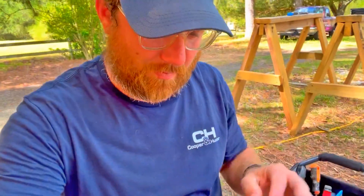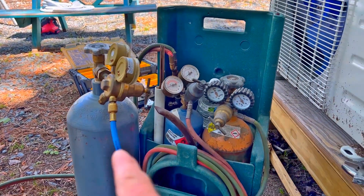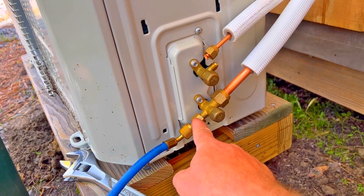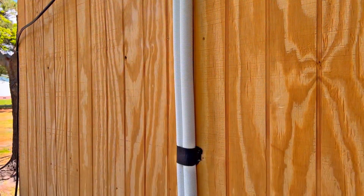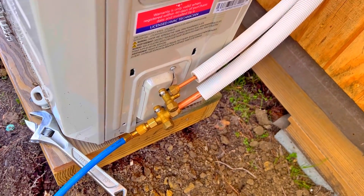It's hard to do that while trying to hold the camera, but we got to just over 25 - right at our torque specs for this one. The unit started to shift a little bit, I should have screwed it down - hindsight is 20/20. What I did next is braze up the unit using my oxygen-acetylene torch. I set a little bit of low-flow nitrogen through all the way into the vapor line. We step down from five-sixteenths to one-quarter inch, just like most mini splits, so you have to have that fitting. I protected the building with some sheet metal, brazed both connections up top with nitrogen flowing back down through the saturated vapor line and coming out through the second flare - which we're about to attach so I can pressure check it and then put it into a vacuum.